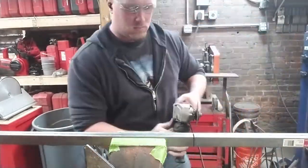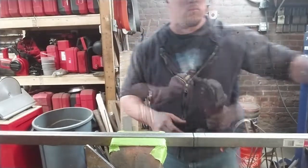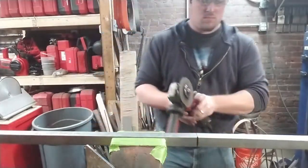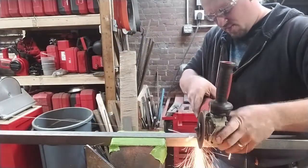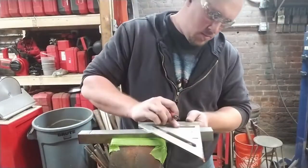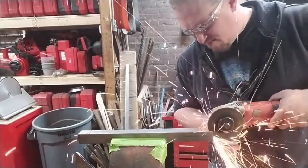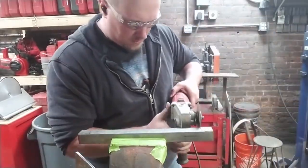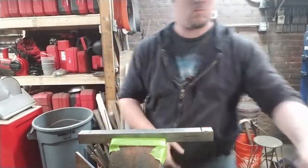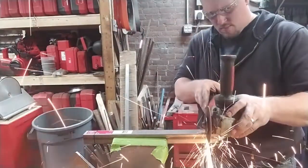That's okay — I'm going to have a second baking later on. Now, since carbon migrates out of steel when it is in a low carbon environment, for instance when it's just in a fire, and carbon migrates into steel when it's in a high carbon environment, for instance when it's packed in charcoal or graphite — graphite would be much easier to use, by the way — this coffin, since it is also steel, will also become a piece of high carbon steel, improved from the inside out.